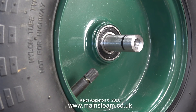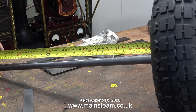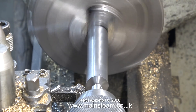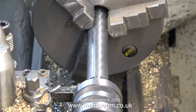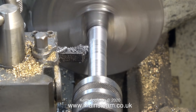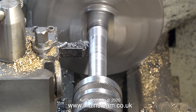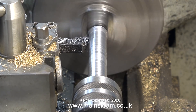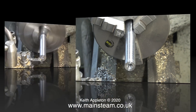Here's a piece of bar that I've just turned sticking out of the wheel - it's a really good fit. I just need to shorten it, hence the felt tip pen mark. Now it's time to double-check the measurements between the wheels to mark off the position to turn the other end. At this stage I didn't pack the bar where it goes down the spindle, because I only noticed what was happening when I was editing the video. Here I'm centre drilling the end, mounting a live centre in place, and then commencing the turning. This is actually the finishing cut, and as you can see there are still some lines in the work, but they're not as bad - the piece of bar sticking through the spindle is not quite as heavy as before, so the vibration is a bit less. I just used some emery cloth to clean up the surface.